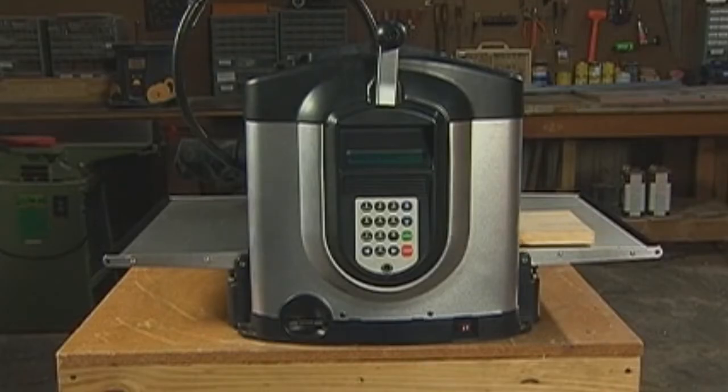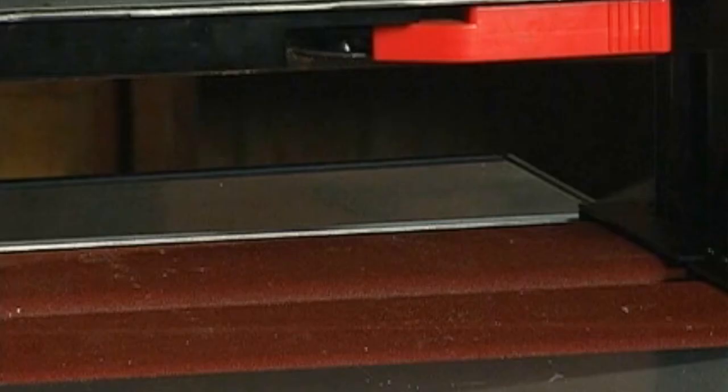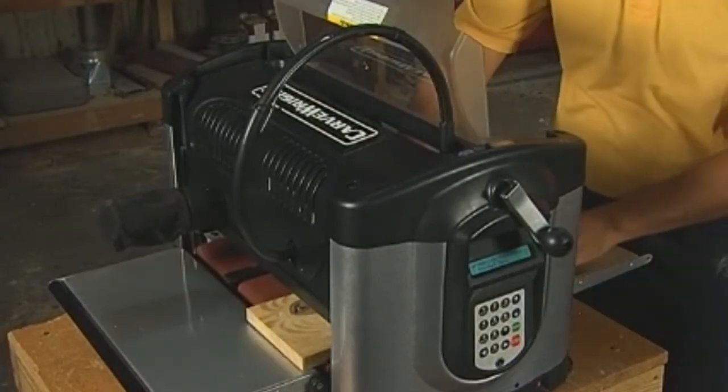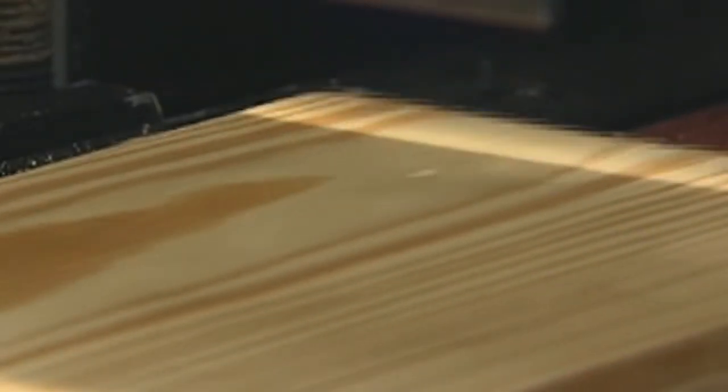Loading a workpiece: Proper installation of the workpiece is critical to the performance and continued operation of the machine. To properly insert a workpiece, first press down on the sliding guide plate release lever and move the sliding guide plate to the right so that it will clear the width of the workpiece. Use the crank handle to raise the head high enough for easy insertion. Never crank your machine head above the slots on the four guide posts or it may get stuck. Lay the workpiece on the traction drive so that it is centered lengthwise under the head, then place the board firmly up against the squaring plate and on top of the board tracking sensor.